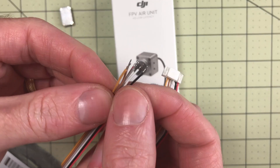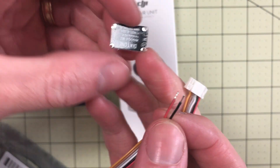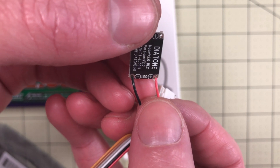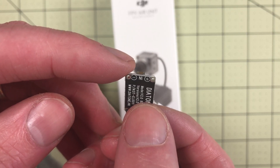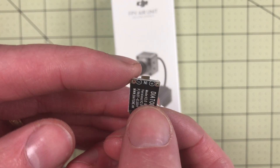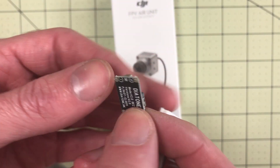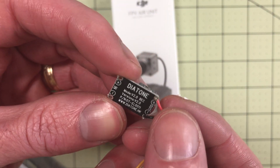I've got one of the FPV air unit cables here with red and black connectors. It's straightforward: connect the red to the plus out and the black to the minus out, feed that through, and put some solder to tack it on. Make sure your cable is the right length and you're ready to go. Depending on your flight controller, if it has pads that feed line voltage that would work, since the draw is pretty small. Or you can solder wires directly to the battery pads, depending on what's most convenient. Then wrap the whole thing in heat shrink.